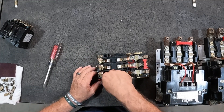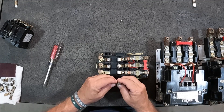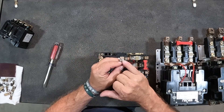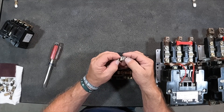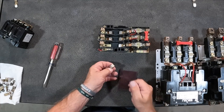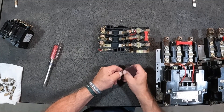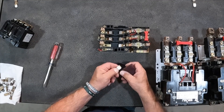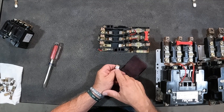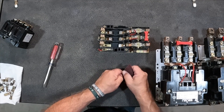The point of this video really is just to show you how to extend the life of these. In other words, during a shutdown or a planned outage, you would cycle all your breakers off, pull the head off your starter, and look at this contact right here. You see how it's got just a little bit of arcing right there — that's not bad, not pitted real bad. So we'll take it, grab a little bit of Scotch-Brite. Some guys keep an emery board in their tool bag — you can reach down inside a little easier and clean them up. Little stuff like this can extend the life. If we didn't address that arcing and just let it continue, it would eventually build heat, and that heat would deteriorate the contact tip and eventually break it down. So this can help extend the life during your preventive maintenance.